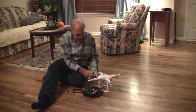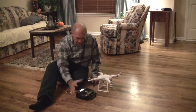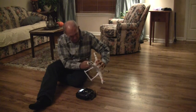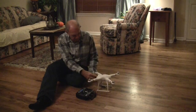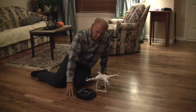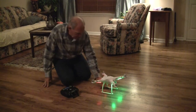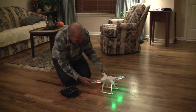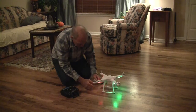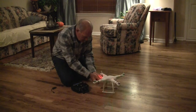So I'm plugging in the USB port for the initializing. I'll turn the transmitter on, put the battery in, and then connect the battery. I've got a red light here. What I do is push down on this button — the light turns off, then turns to red. Looks like it's calibrated. We'll take the dongle off, disconnect this, and I'll do everything once again.